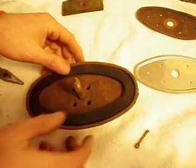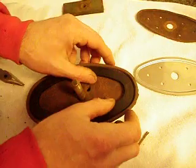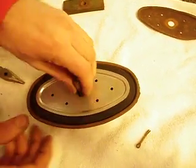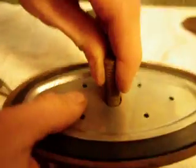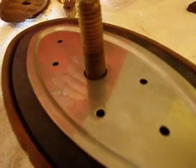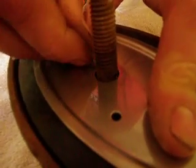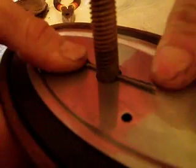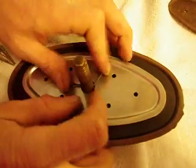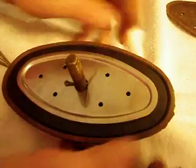So I'll go ahead and put the rubber gasket in place. I'll put the baffle plate in place. I want to make sure that I line things up so that the hole is this direction across the cap, so that as I push down a little bit, I can slide my cotter pin through that hole. Sometimes it does require a little bit of force because the new gaskets are a little bit thick, and that just helps maintain a good seal.